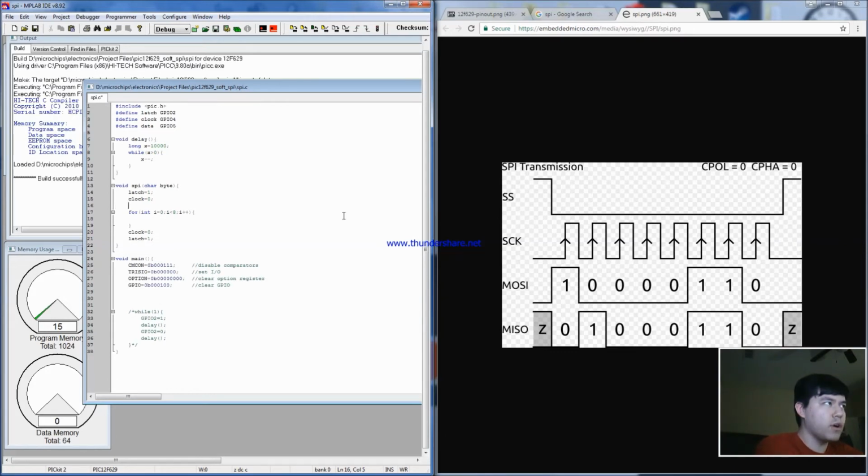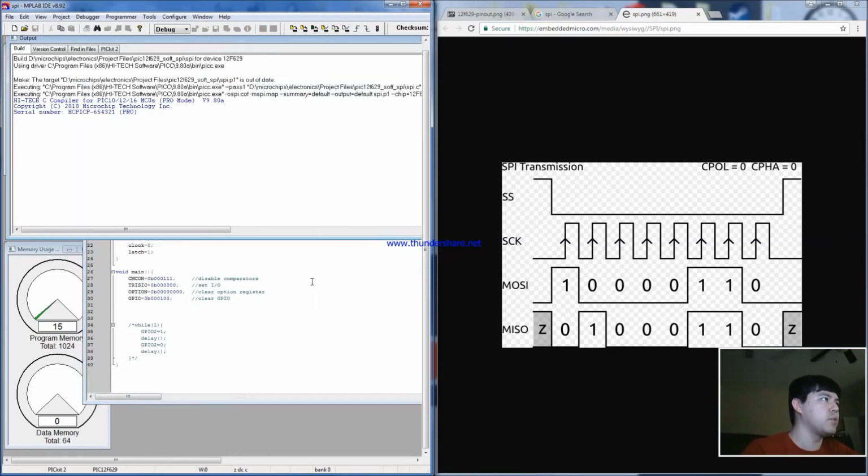Now before we start communication, we should have data in a known state as well. So we'll just initialize that to low, and then finally, right before we enter that for loop, we will switch latch to low, which means start sending data, which is basically this falling edge here. And so this should set everything up. And once again, after it's done, just to have it as a known state, we'll set data equal to 0. Let's save the file and make sure we didn't make any errors.